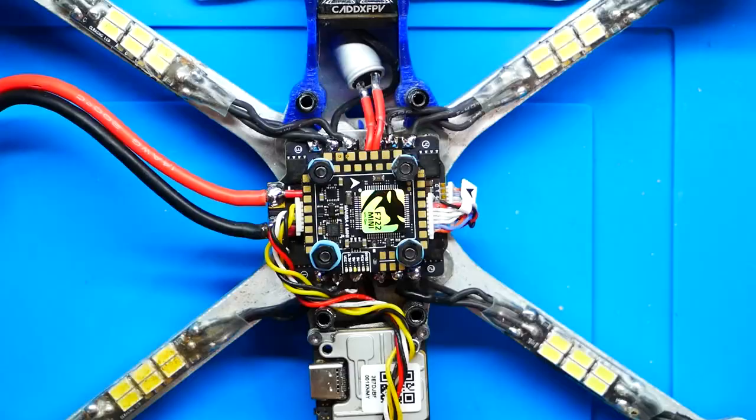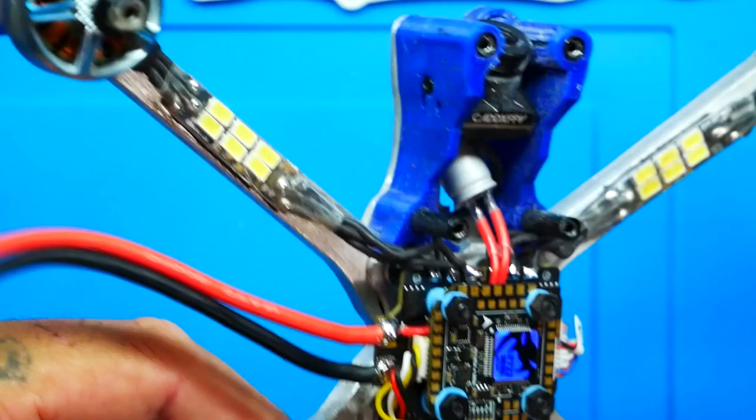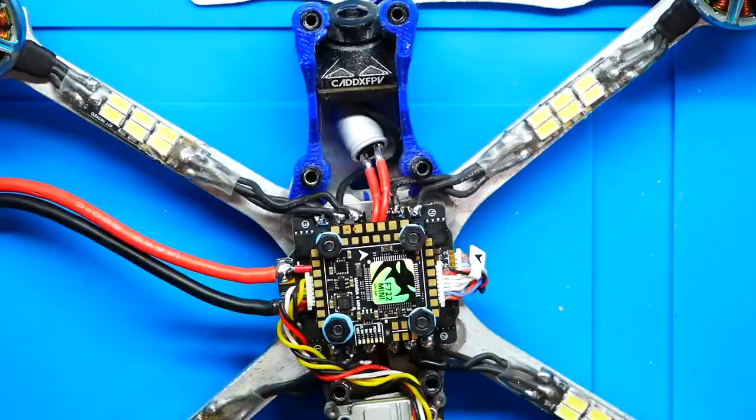All right, pilots, it came out absolutely gorgeous. Plug and play on everything. Big, beautiful pads on the ESC. I went ahead and soldered up my XT60 right here. My capacitor before was kind of ran underneath, not my favorite. So I went ahead and tucked one in right here and then wrapped the wires around and tied it in. I had plenty of grommets and gummies and spacers and everything. They came with everything. And because it's a 20 by 20 stack, they gave me mounting options for M2 and M3. Grommets, screws, everything. So I'm going to go ahead and power it up for you guys.